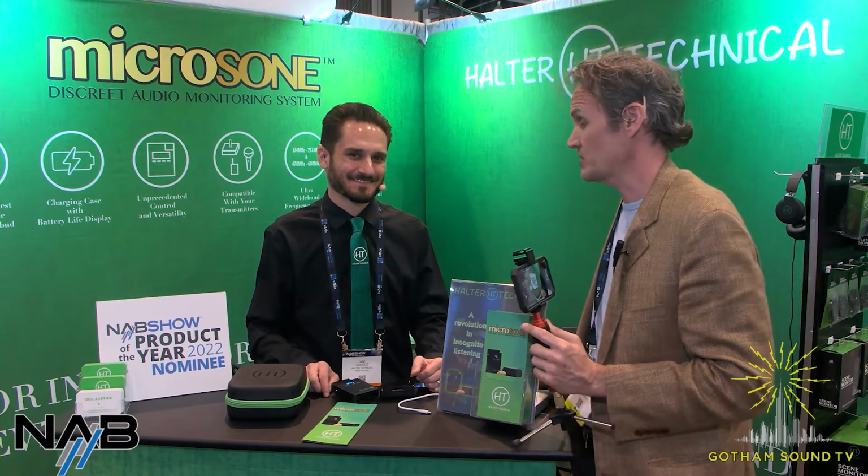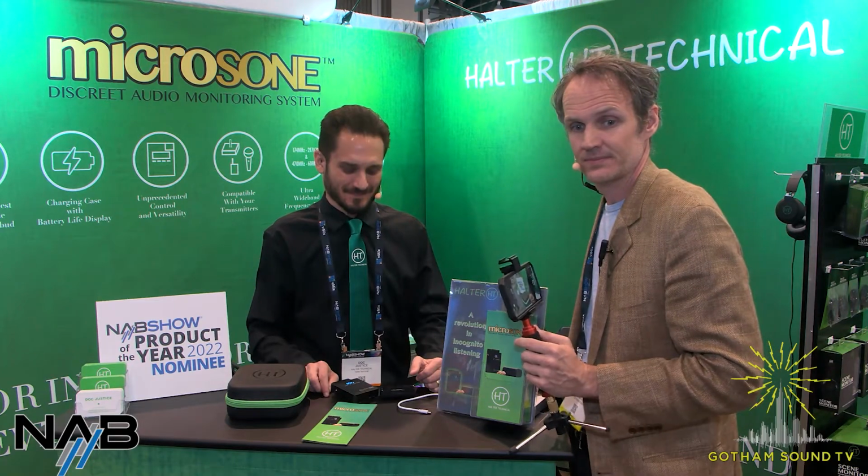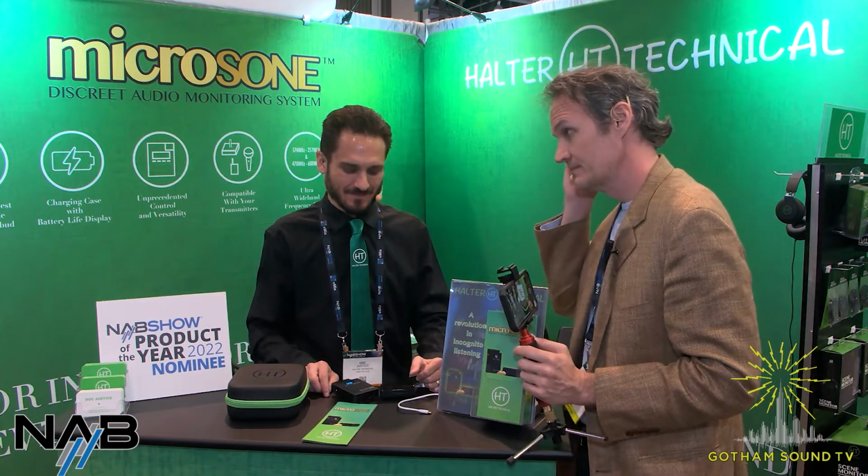Oh, wait, we have a question. Okay. Go ahead, Joe. What is the question? What version of Bluetooth does the pack use? Yes, so the control pack uses Bluetooth 5.0, and it's on the aptX codec. That gives us the lowest latency in the smallest package possible. Got it. Do you know what the delay is with that particular codec? As we finalize the firmware, I'll have more specific numbers. Right now, it's looking roughly 1 or 2 frames of video.